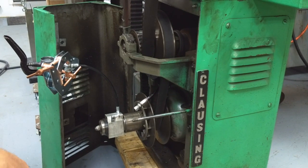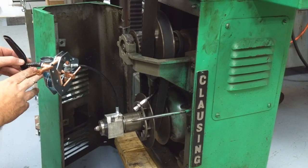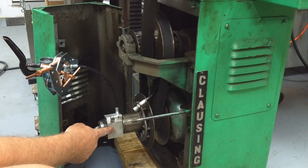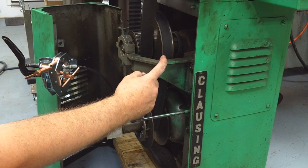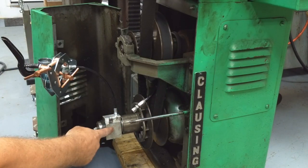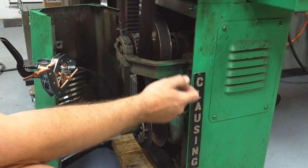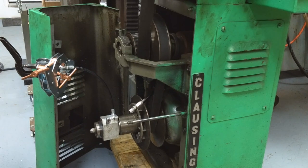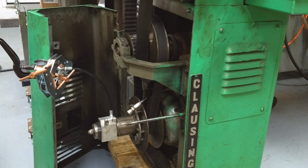What I have is the grease gun head set up here, forcing hydraulic fluid down into the cylinder, and it worked — I was surprised. So I'm going to turn it on and you can watch as I pump more hydraulic fluid down into the head unit down here. These plates will separate and you'll hear the speed increase on the headstock of the lathe. Let me turn on the three-phase power and we'll get it going.